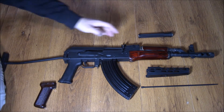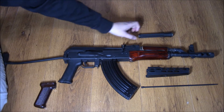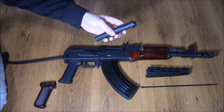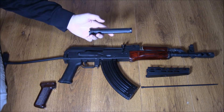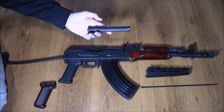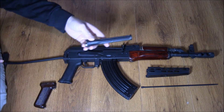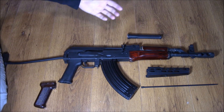Now, the wood around the gas tube — that's a completely different story. This is a standard AMD65 gas tube, and one of the problems in comparison to pretty much every other AK gas tube is it's a lot shorter, but there's also nowhere for the wood to clip into. So what you have to do is take a gas tube off any AK variant and cut it down to the length of this one.